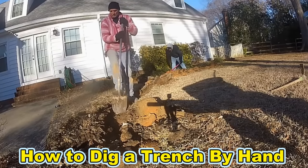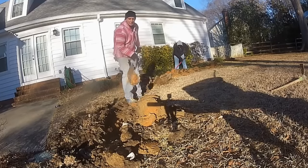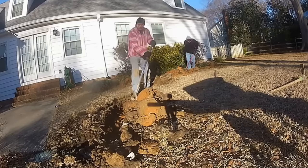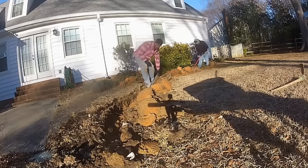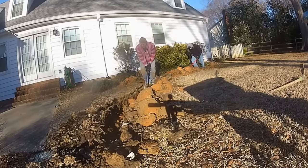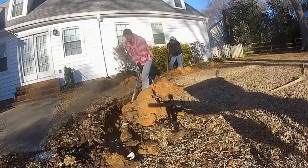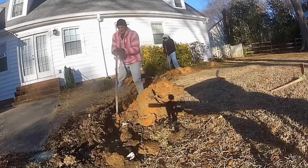We're digging backwards through the trench — you don't have to jump on the shovel, just sink it down and pull out the dirt. Scoot the shovel back about 4 to 6 inches from the last position, use your body weight, wiggle it straight down, and pull out big chunks of dirt. Once you go about 10 feet backwards, turn around and come back to clean your trench. Place the shovel on the bottom and push it forward using your body weight — this clears loose debris and makes it easier to go deeper if needed. Remember: water runs downhill.